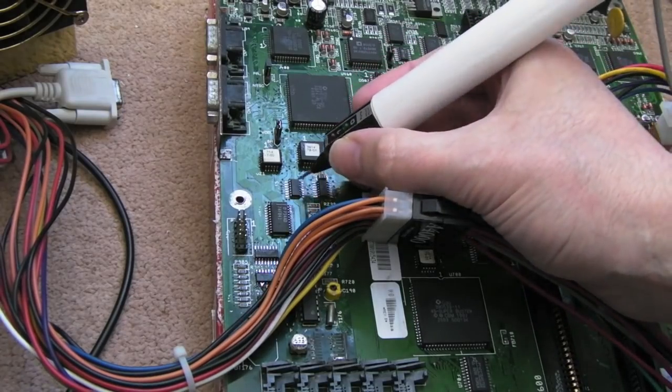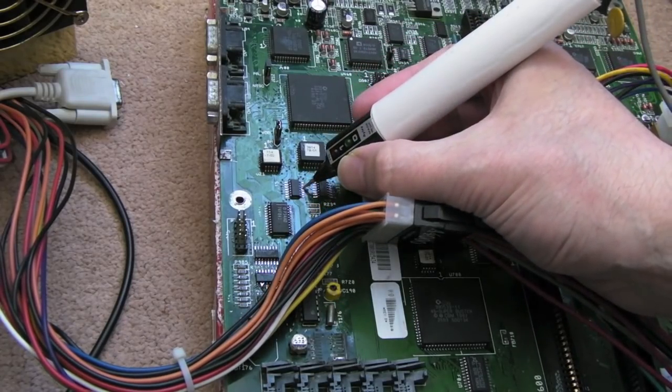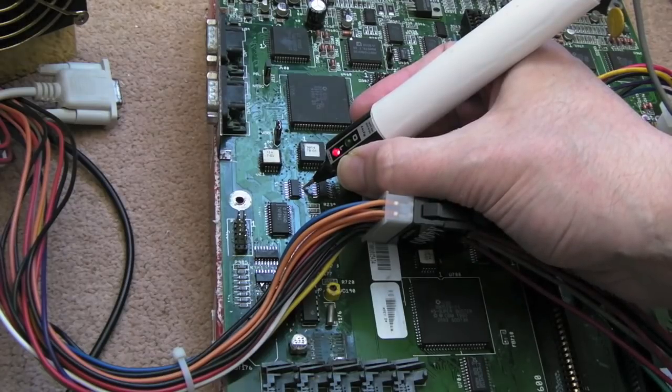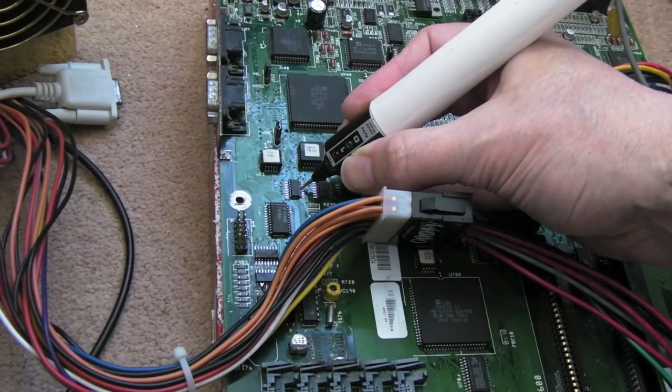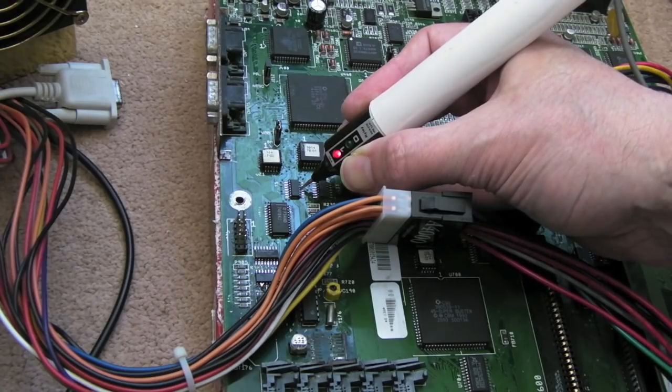So it's just the same after swapping that crystal, although we're not seeing that high pulsing on the clock pin. But can you see this? I've switched it to its external, the jumper's to the external position. And did you see we get a bit of activity? Not masses, do you see that? It goes low then high. Low then high. This is the read-write pin, by the way. Which makes me think the CPU's running, then it crashes.